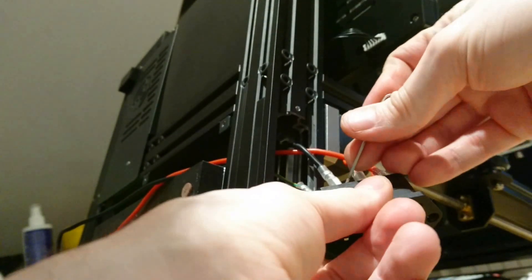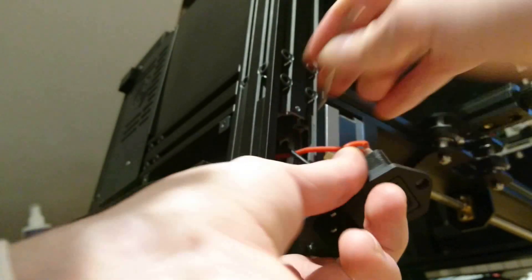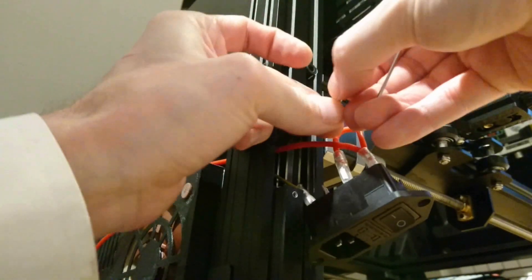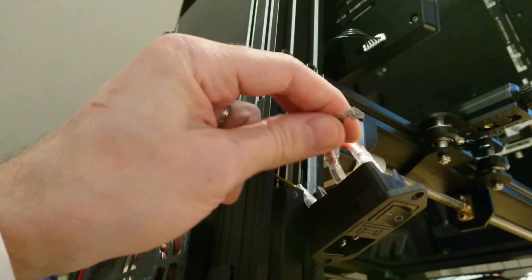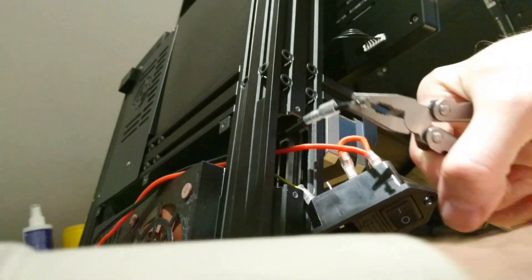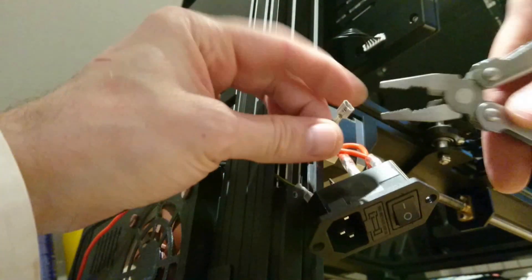To remove the pins, you need to get the silicone boot off first — just prise it from underneath. Just the smallest Allen key will do. It might come off on its own when you pull the spade connector, in which case it's probably a bit loose. You can also grab it here and pull it, and you can push with the smallest Allen key where there's a locking catch to help. This one's obviously a bit loose, so I'm actually going to tighten it a bit.